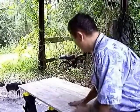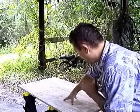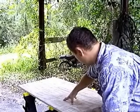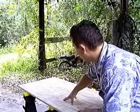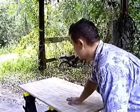I've got my first side gridded up here, and number one thing is since this is such a shallow cut, at first I was trying to use the guides on the saw but they were way off, and I ended up messing a couple pieces up. We're going to fix that in the next step. But watch the blade on the saw instead of trying to use the guides, and make sure to just knock off that pencil mark on your board instead.